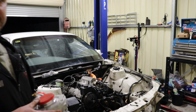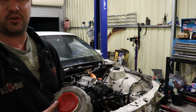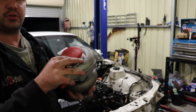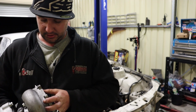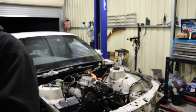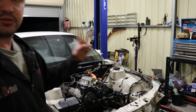and they're labelled as GT3582s, but I haven't gotten the verniers or tape measure or ruler out to measure them, but they look to me about the GT30 size. I'm going to weld up this internal gate flat. We're going to run a couple of external gates on it. But yeah, he has two of those.